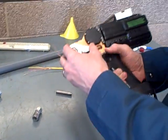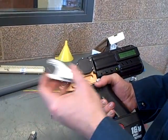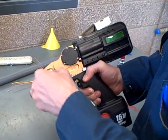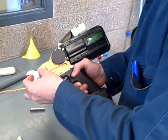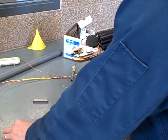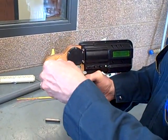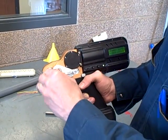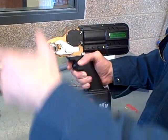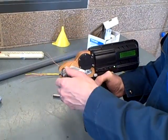So we're in tightening mode. As you can see, it's got this clamp here that holds the fitting in place. It also has a rotary jaw that's going to grab the nut on the fitting and turn it at 450 degrees. The purpose of this device — the genesis of it — is that it was made for zero gravity work in space, where people on the space shuttle, for example, might need to tighten a tube fitting. This device holds the tube fitting in place in such a way that there's no torque imparted to the user, so the astronaut doesn't get thrown around. He just puts it in place, holds the trigger down, and it does the rest of the tightening on its own.